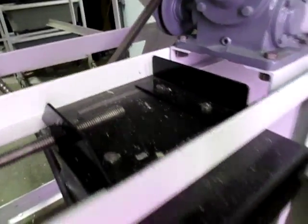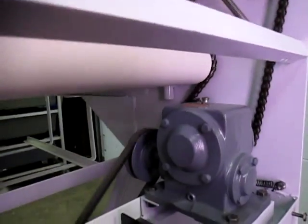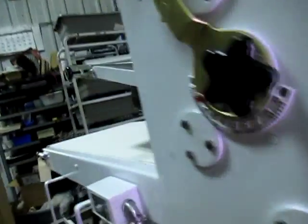You can see the motor goes in and out, so the belt gets tighter. It's not really tighter — the size of the pulley changes so it goes faster and slower. The chain is moving right along. Most of the noise you hear is from the belt. This is the pulley here, and this pulley gets wider and narrower as you pull it out, so the belt rubs on the side of the pulley — you get a lot of noise out of that. But that's a good effective way because you've got a lot of surface area for this belt to grip on. You don't have the slippage that you might have without this type of pulley. A lot of the noise is also coming from the scrapers.